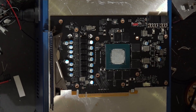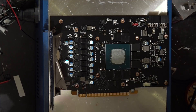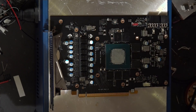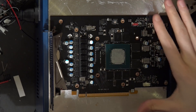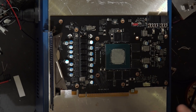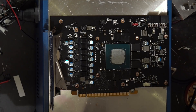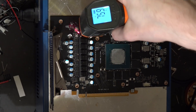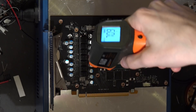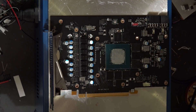That should lead to a roughly 66% increase in the card's power limit. It's been sitting on the hot plate for a while now and the hot plate is set to 125 degrees Celsius. The idea behind having a hot plate like this when soldering is that it allows you to basically bring up the PCB temperature significantly above room temperature, which makes it much easier to flow solder around the board. At this point the PCB is up to around 70 something degrees, so it should be much easier to work on than if it was at room temperature.